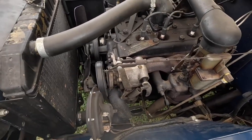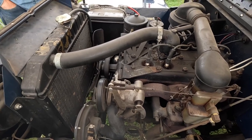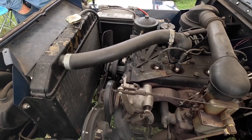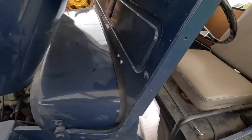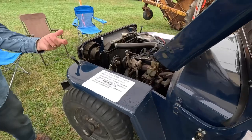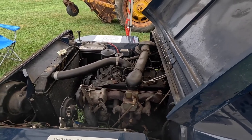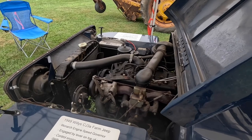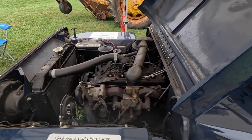All the what we refer to as the farm Jeep equipment. That way, whenever you're working a hay baler and the PTO should be running at 540 RPM, it will stay there whether it's loaded or empty. And it works completely independent of the regular gas pedal. What you did is you unhook the gas pedal linkage — a real quick fix. The governor itself has a handle with notches in it, each notch being a couple hundred more RPM. It's kind of like cruise control. Actually, there are guys who, when they're on the road, use it as cruise control.